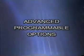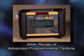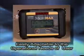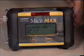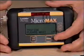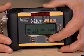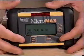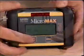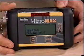Advanced Programmable Options. One of the hallmarks of the Micromax Pro is its wide range of advanced programmable options, allowing it to be easily adaptable to the operational needs of the user. To access advanced programmable options, first turn on the unit. When it begins counting down in the test mode, hold down the mode button between 5 and 7 seconds. You can scroll through these options by repeatedly pressing the mode button. To enter an option, press on-off. If you accidentally bypass a desired option, you must re-enter advanced programmable options from the beginning. Refer to your manual for a more detailed description on programming options.